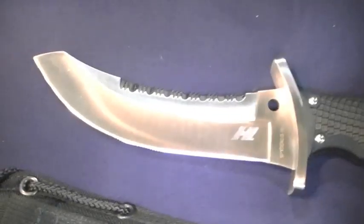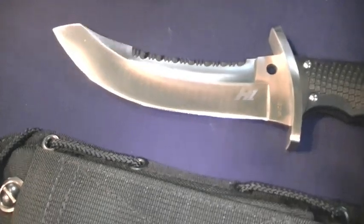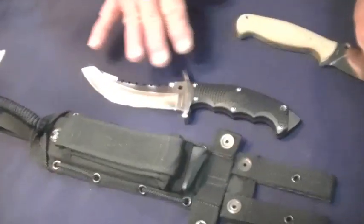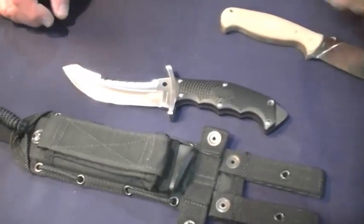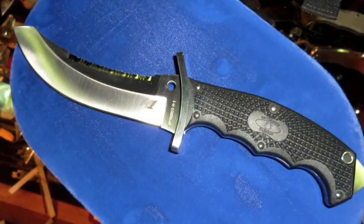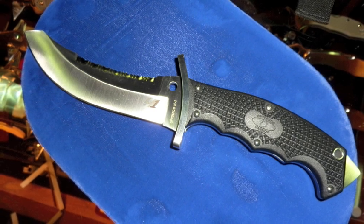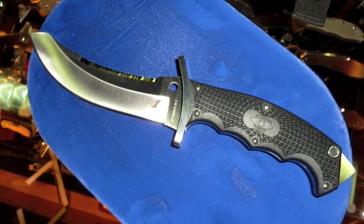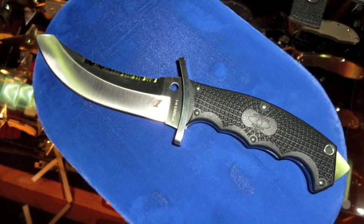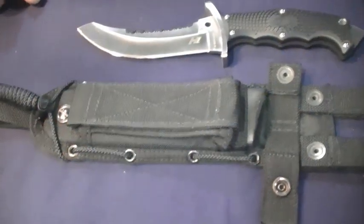They make good stuff. The steel is H1. Yep. It's an austenitic steel that is work hardened, so it's differentially hardened by the amount of work that's being done. Gary Raffaelli wanted a 4mm thick H1, so it took a little longer to create the knife because of the ability to produce the steel in that thickness. We use a full serration at the top. That was the requirement of the design. In the original Hobbit, the serration is more sawtooth for trapping and grabbing and tearing rather than actually slicing. Right. But in this application, they wanted more slicing capability.